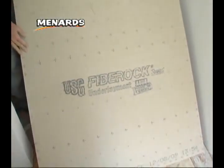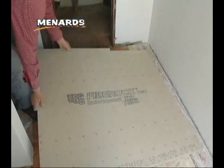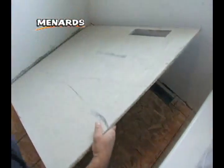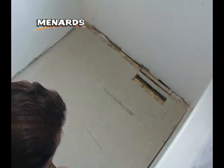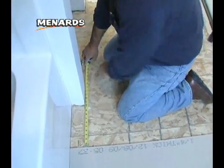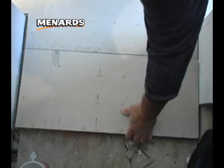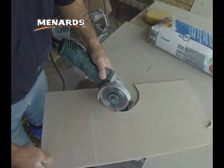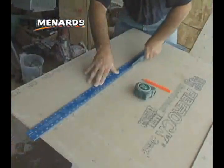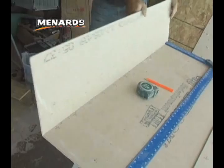If you're changing your floor from vinyl to ceramic, you will need to add the appropriate underlayment over the subfloor before you can begin. It is a good idea to dry-fit all of your underlayment pieces before securing them to the subfloor. Measure your room carefully and lay your pieces in where they fit best. Cutting underlayment to fit into certain spaces can be done several ways. For straight cuts, it's easiest to use a utility knife and straight edge to score and snap off pieces that aren't necessary.